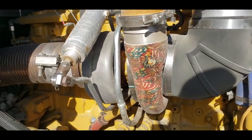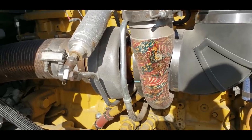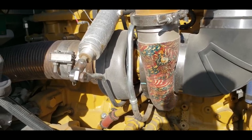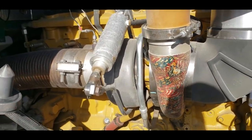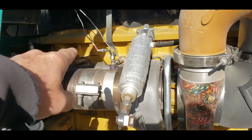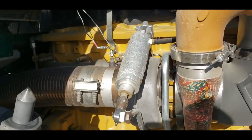It's kind of like trying to run a marathon and breathe in with your mouth and exhale with your plugged-up nose. The turbo is just not going to work with those restrictive small-port Cat manifolds. The ports are much bigger, and on the C15 it's mandatory — they use a tiny port. When you put the gaskets on, there's a tube thing in there that restricts it.